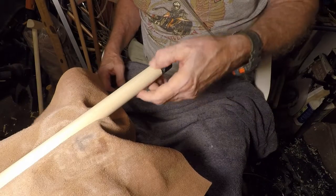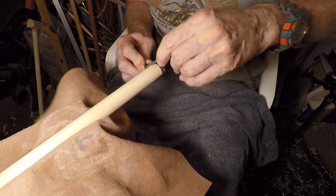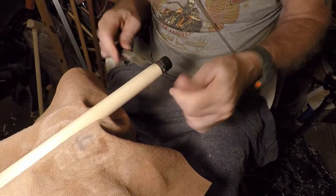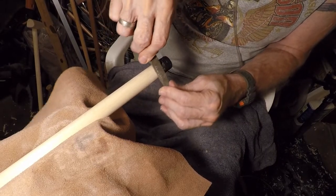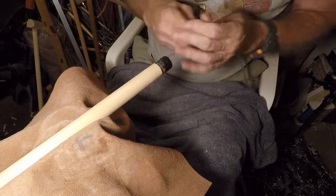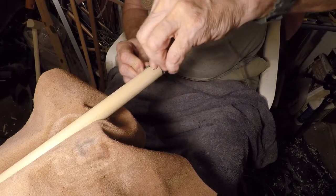Okay, I had to switch up a little bit on my technique of sanding. Right now I'm using a small file, and I'm going around very sharply on the edge, slowly I should say, and I'm filing it until I see that my file is actually taking some of the black tape off. And I've got it in a vise, so it's held pretty good. Actually, this is just a form of draw filing, like you would do on metal.